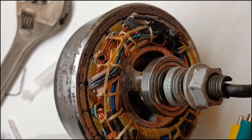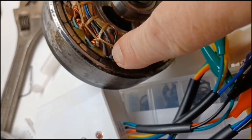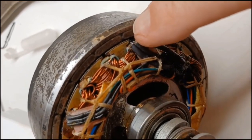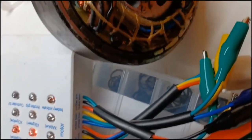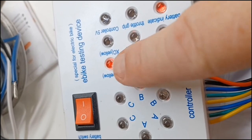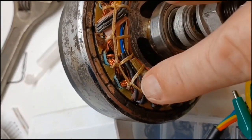These are the replacement sensors we bought for this particular motor. You're going to see A, B, and C — or blue, green, and yellow. That's the yellow one that was in failure, that's the green, and that's the blue. Over here, once again, you have blue, green, and yellow — or A, B, and C — for the hall lines.